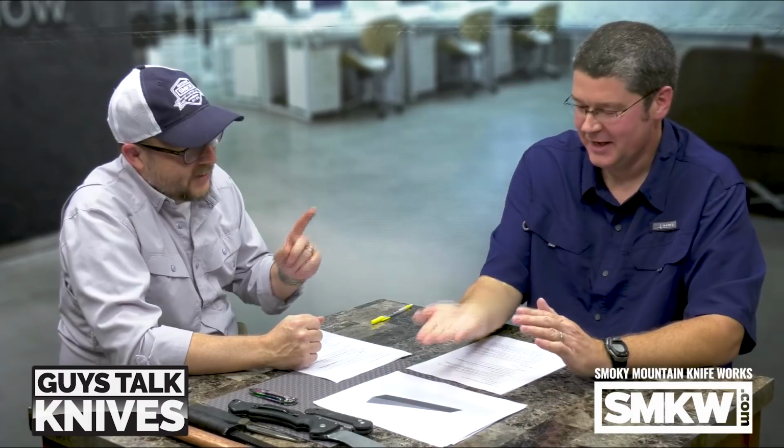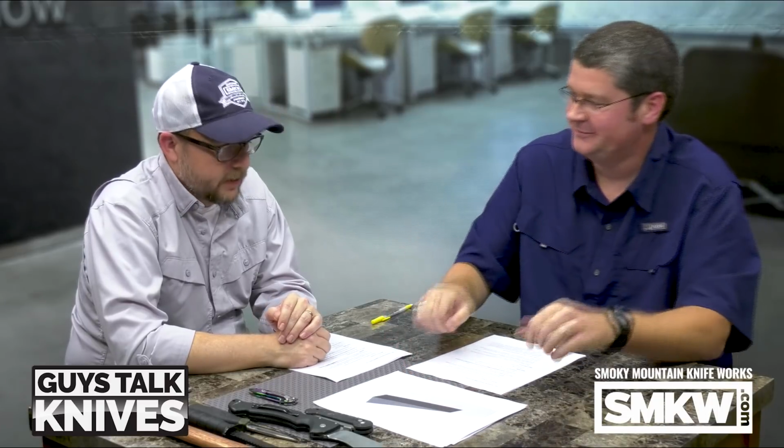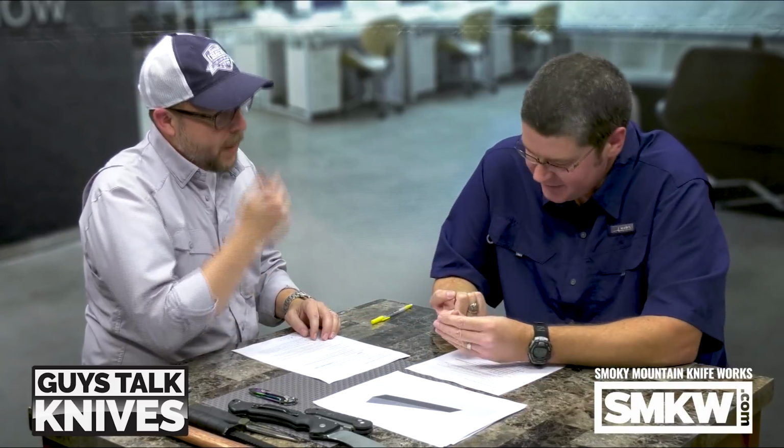And one more thing. Let's say I have the stone, and I've got my nice angle with the blade. If I do one pass of a really rough stone where my angle's too high, everything you just worked on is gone. Yes, and I noticed that with the stone, as I'm working it and I'm doing some nice passes with it, I would hit a point where I got complacent. I've done 15 strokes on each side. I get to 14 on the last one, and I let it jump and I let it slap one time in the middle. The last time I got complacent, I have a nice line on the tip of my finger right here, and it was 3 stitches to close it up. Wow. Yeah.